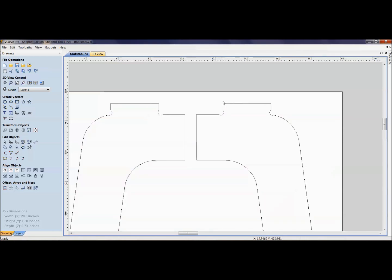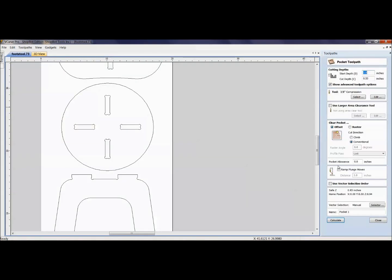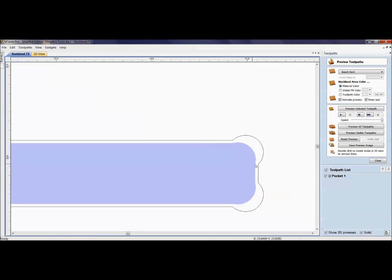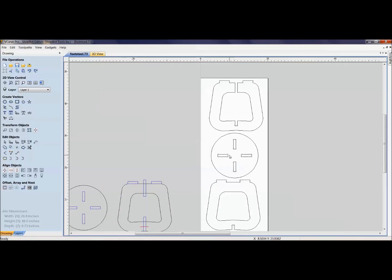I might change to a quarter-inch bit instead of a 3/8 bit. Even going into the tool path and adding a pocket allowance — say negative three thousandths — is a valid route. When you calculate and preview with a solid on, you can see the pocket offset, but even that small offset won't be enough for the dog bones to get around. These allowance offsets in pocket and profile tool paths are very valuable, but for this particular goal they're not quite the right approach.